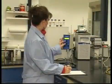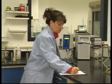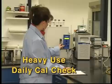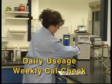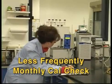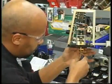A common question is how often a calibration check should be run. The answer depends on how often the instrument is used. If an instrument is being heavily used on multiple shifts, a daily calibration would ensure accuracy. Daily usage five days a week may require a calibration check at least once a week. For instruments used less frequently, once a month or once every few months will be fine. To ensure the health of your instrument for many years, return it to Brookfield or an authorized dealer once a year for a full calibration, certification, and cleaning.